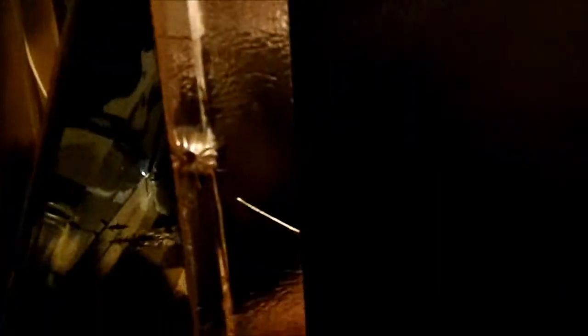I came up here and got 5 and 3/4 from that two-by-four to it. As long as you have this measurement and this measurement, you can get the rest of it. Really you just need a couple of measurements: from the top of the flange to the bottom of the S-lock, the total measurement from here to here, and then a starting point — you could use the furnace up here or just use a two-by-four. Once I've got that measurement done, I'll go cut it and bring it in and put it in.